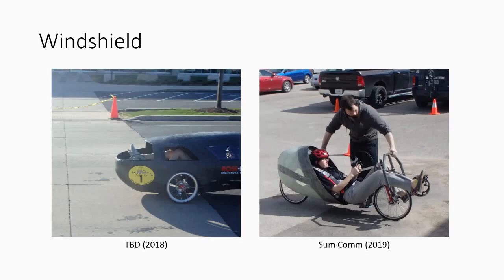For Shrike, the team wanted to produce a functional windshield that ideally would be flush with the fairing to improve aerodynamics, but ultimately a see-through portion of the fairing that would protect the rider from small rocks and debris, while also not breaking during a crash, was all that was required. The team decided to form Shrike's windshield out of acrylic. This material was selected because it can be easily shaped and is somewhat resistant to breaking. Of course, clarity is key as well.